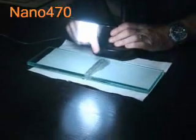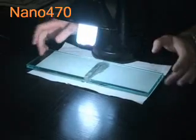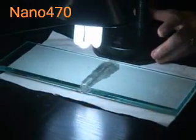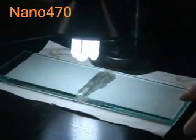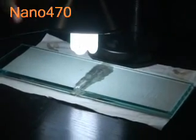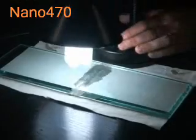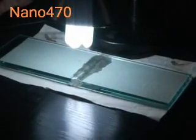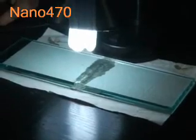We can use the compact fluoro over this small joint for a specific reason: the joint is relatively small in length, so we can cure the whole joint at one time. If the joint was any longer, then we would use a fluorescent tube, because we like to cure the whole joint at the same time. Get your light nice and close and let that white fluorescent light cure the adhesive.